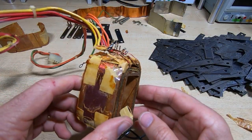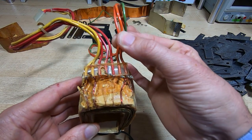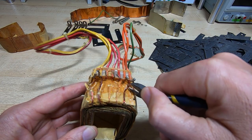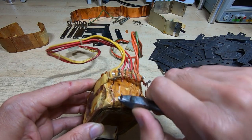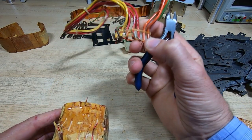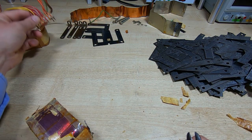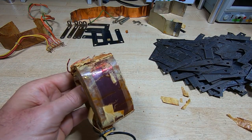Here is a closer look at that arrangement. There's a little plastic spacer — a plastic sheet with holes in it — to keep the wires separated. All the wires are terminated and then folded back. I don't intend to reuse these wires, so I can just cut them off, clean up the block, push the ends through further, and make fresh terminations when I refit it onto the transformer. The next step is to start unwinding and counting turns.